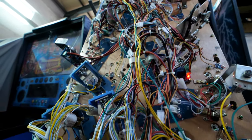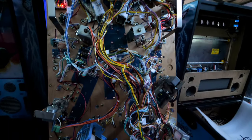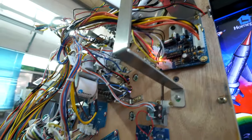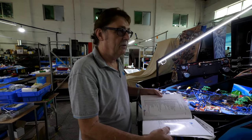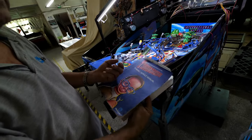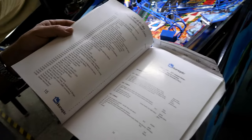Mostly what you can see under here are lamp boards with LEDs on the other side to illuminate various places on the playfield. There are control boards here and there, and flipper control boards on top, and various other small boards. You might notice something about these boards — they're all made with through-hole parts. It's done that way because I'm firmly of the belief that you should be able to repair your own machine. There are about 50-ish printed circuit boards in the machine, listed in our service manual that comes with every machine.